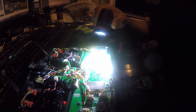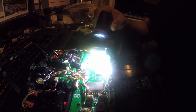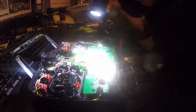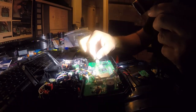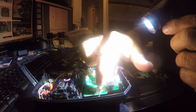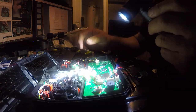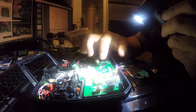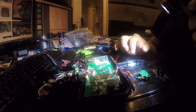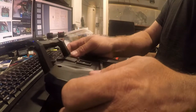Kind of cool that the board has an I/O header. It's got a data input output clock, 3.3 volt ground and reset, so that's a programming interface. And then your switches come in here, and your boards are multiplexed in through this, and those are the switches on the other side. Yeah, it's a good basic little unit. It's amazing what you can do these days, and then that's your radio, which would be under the tin. So anyway, let's put it back together, because that's all we needed to do in here.